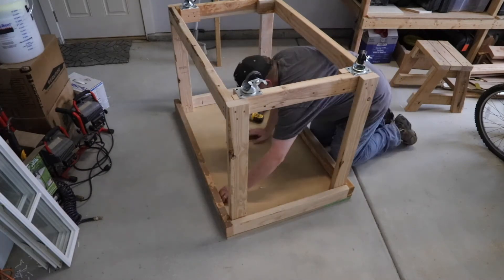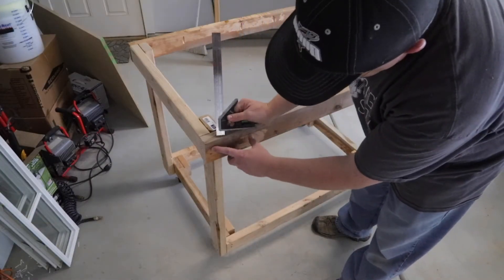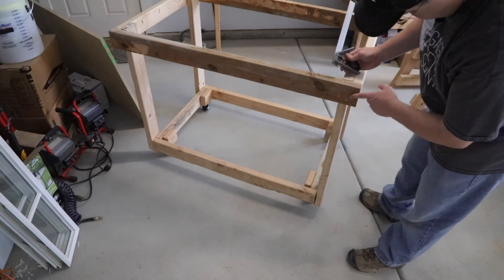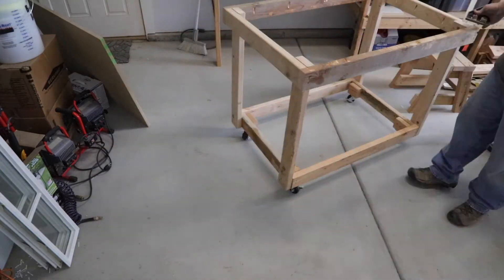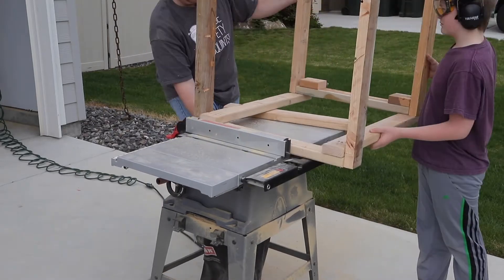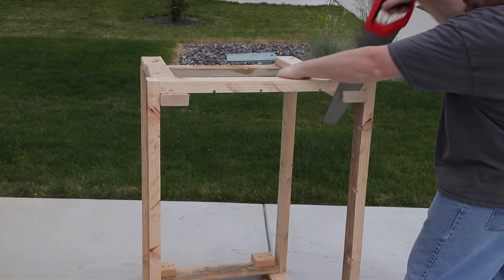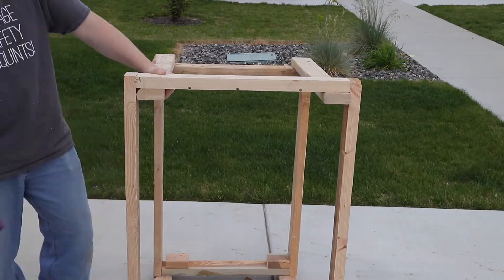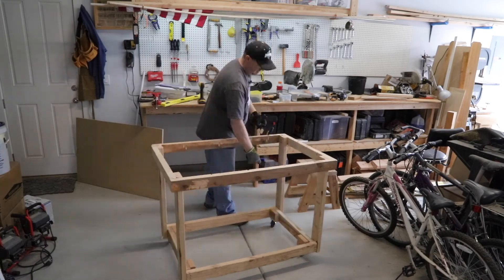The top had to come back off and I had to check very carefully for nails in the cut path of the saw. You can see there's a nail head right there, so I'm going to make sure I cut above that. I screwed up, and the way I'm going to fix it is, well, a little dumb and dangerous — don't try this at home. The table saw did a good job with most of it, but I had a little bit of extra trimming to do by hand. After taking just a little off the top, it fits fine. I had to redrill all the pocket holes and reattach the top.